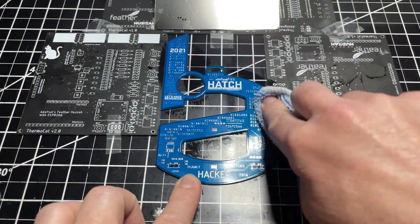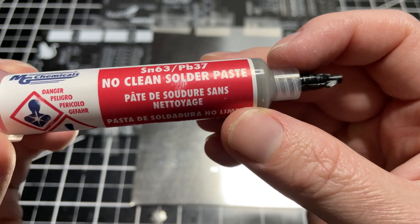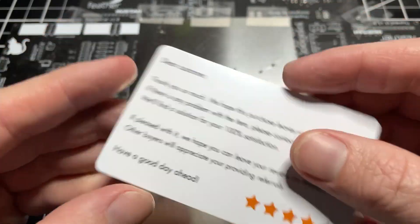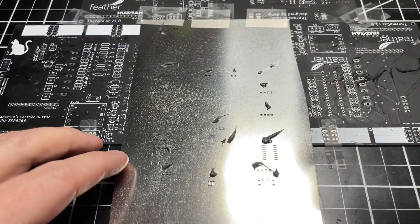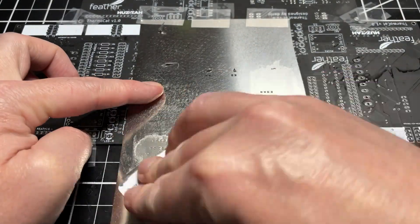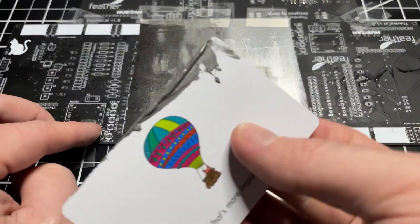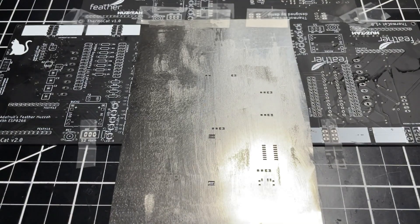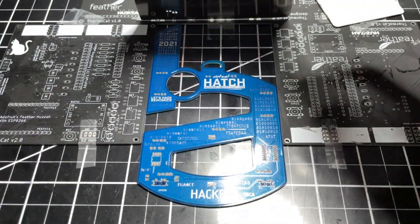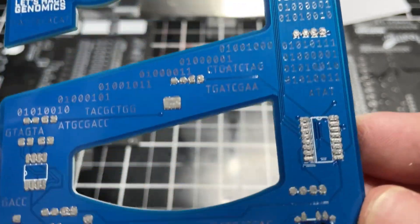What do other people use for cleaning? I'm using No Clean Solder Paste from MG Chemicals and I'm pretty happy with it. I squeeze some onto the stencil around the holes, then grab a plastic card to act as the squeegee. I press down and attempt to apply an even stroke down the stencil. The solder paste should be somewhat evenly deposited onto the PCB through the stencil. I save the leftover solder paste for later. We lift up the stencil and take a look — it looks decent. Remember that the solder paste will wick up during the melting process.